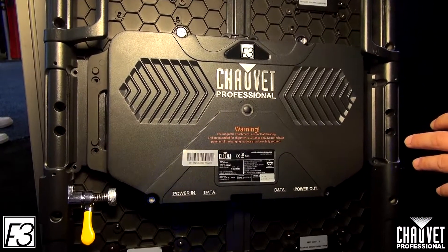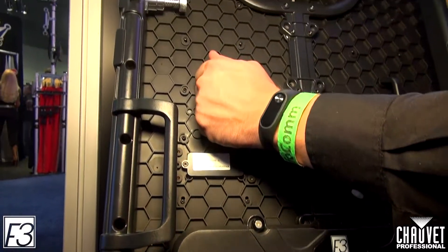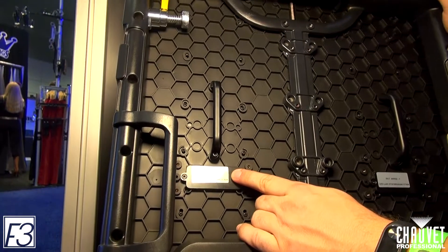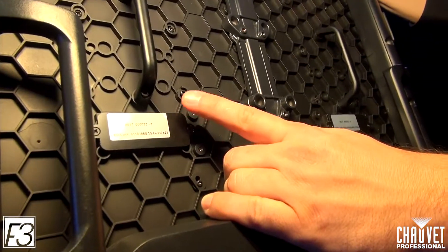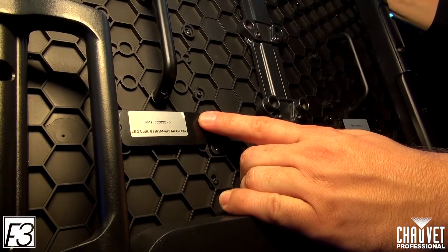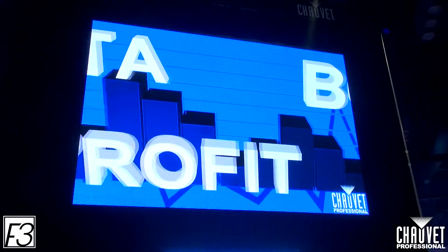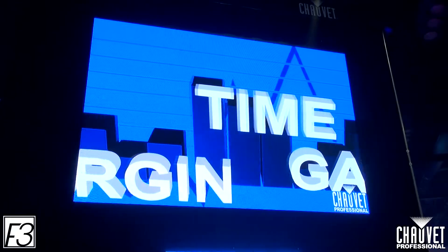We go a little bit higher and we can look at the LED modules. These are LED modules that give you access to pull off the LED modules from the rear — you just push forward and slide right through. Each module has its own label. This label is going to give you your calibration data as well as your LED lot number. So if you ever have an LED module that has any problems, just call our service number and give them your LED lot number and they'll send you the appropriate replacement module to match the panel that you already have.